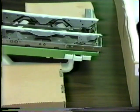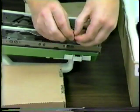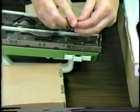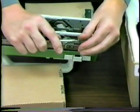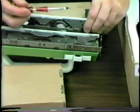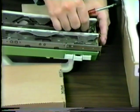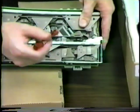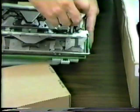A little bit of grease on the washer will hold it in place so that it won't fall off. A split-tip screwdriver will allow you to hold this in place much better. Now align all the openings that the screw will go through. Carefully push through all the openings and tighten it firmly in place.